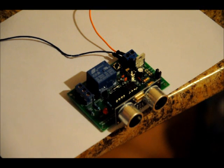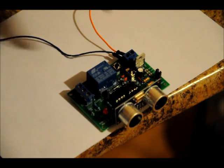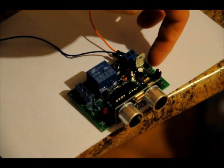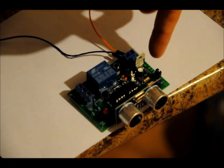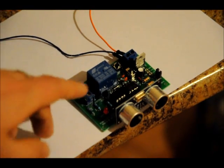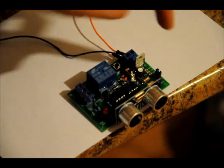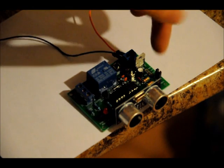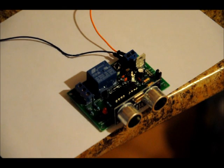And you can also, and I wouldn't suggest using this unless you're feeling adventurous, there's also three pins here for external ground, basically just a ground pad, a VCC regulated 5-volt pad, and an external pad for external frequency. You can actually feed an external frequency between 35 and 50 kilohertz to the transmitter. All you have to do is remove this jumper called 555 enable, and just place your external signal there, and that will feed the transmitter. So you can putter around with that.